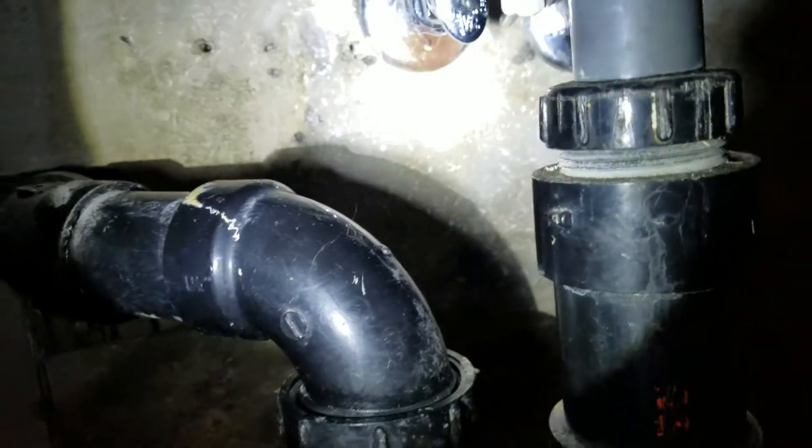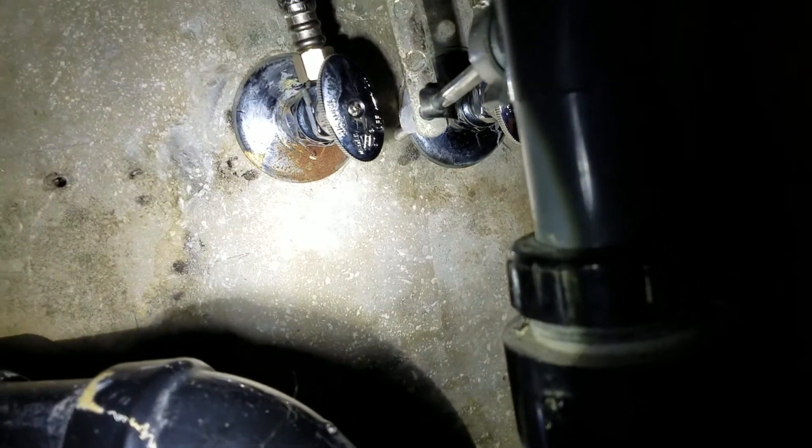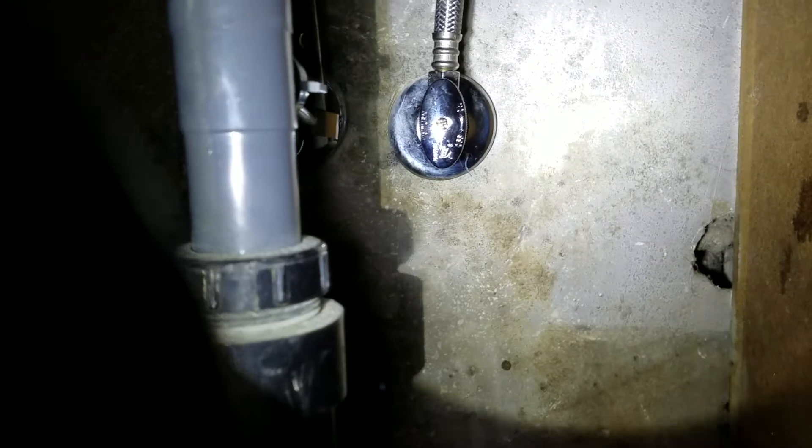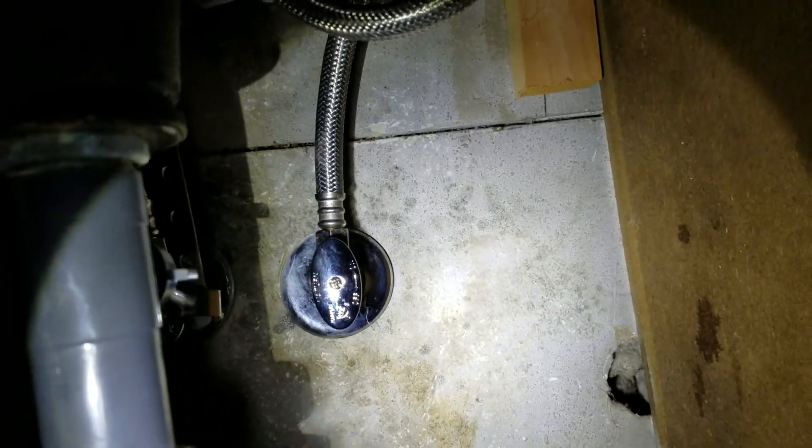What we've got right here is some Blue Fin — these are quarter-turn shutoff valves, iron pipe. The existing pipe going to the wall, the hot and the cold, they're currently corroding. It's a 30-year-old galvanized iron pipe in there, so typical corrosion. The threads are still in good shape, which is wonderful because we could get the old valves off and put the new ones on. You can see hot and cold valves there — cold on this side, hot on the other side. And of course, brand new Fluid Master braided supply lines.